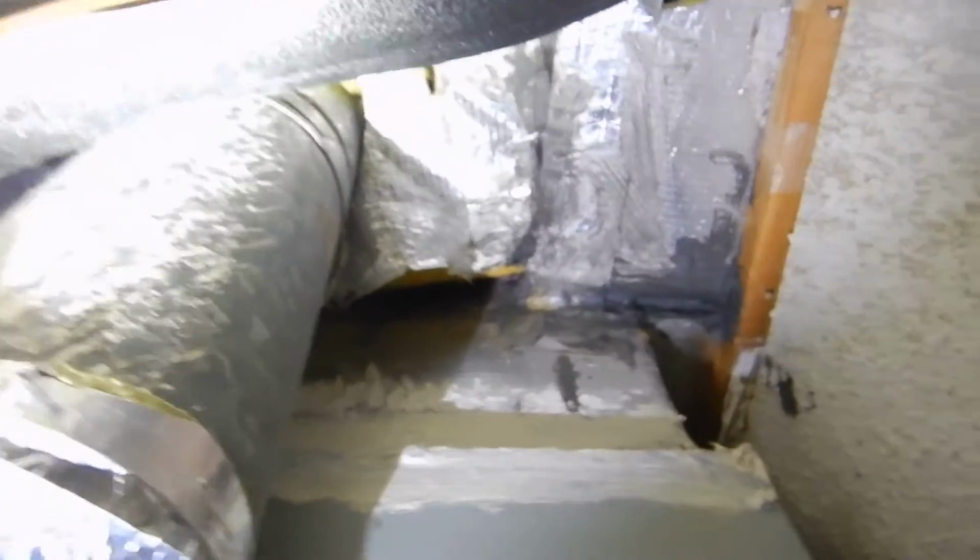So, all right. We do not have a thimble up here. This closet is not insulated. We got weather stripping around this door that was added later because now we want this sealed up, but we also want it ventilated. And so the furnace is not properly ventilated. We got the wrong size air filter.